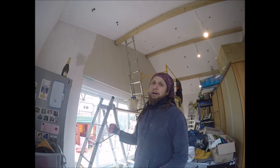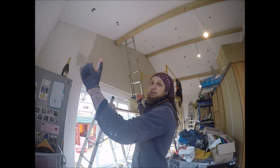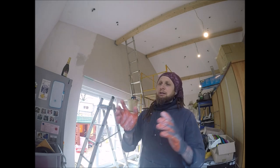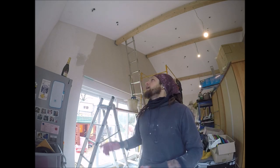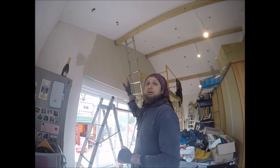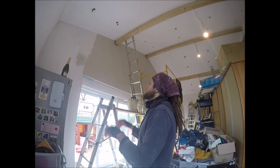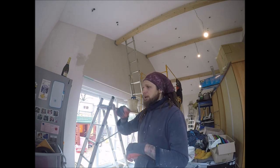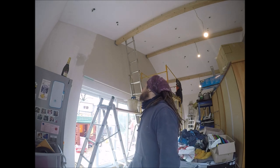So if you sponge float it, what we normally do is meter sections at a time, float it up just once, flatten it off, move to the next station, move to the next station, and that way you can guarantee you won't have hollows in your wall. Once you've done that, then we just wait again, really wait, and then we do a brush finish, just to finish it off and polish it up.